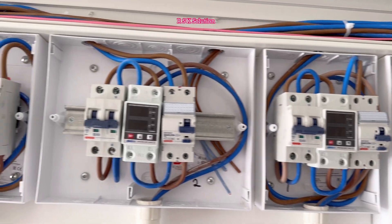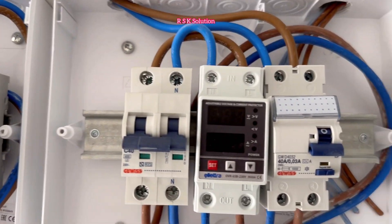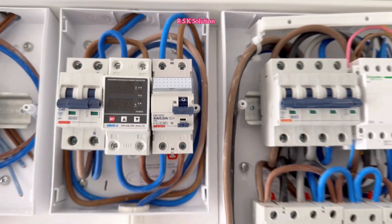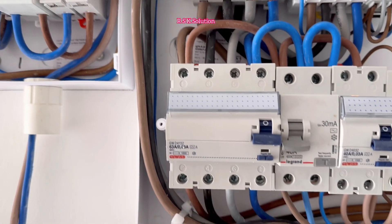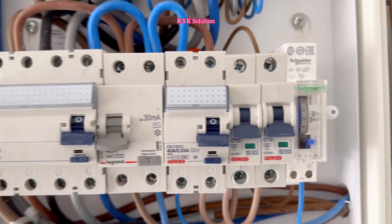Now all the connections are ready. You can see three-phase, single-phase, single-phase, and all others are single-phase. On the three-phase you can see main switch, OVR, and RCD. For the other three-phase, I have main switch, contactor, OVR, and RCD Type B for the lift.